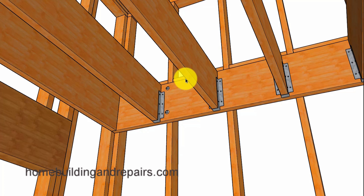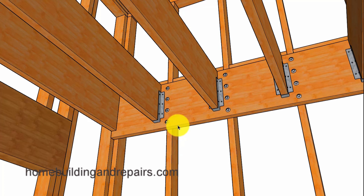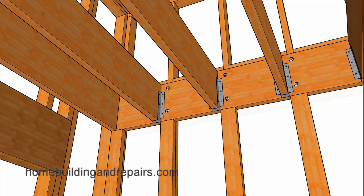As one of the viewers pointed out, that might not provide you with the best floor. As I suggested in one of our other videos, 12 inch on center floor joist spacing might work better, along with the first variation: a larger ledger, maybe a two by 14, so that you could install a few more lag screws. Or you could go back to the two by 12 ledger and install two by fours or larger framing studs underneath the ledger and attach them to the wall framing studs.